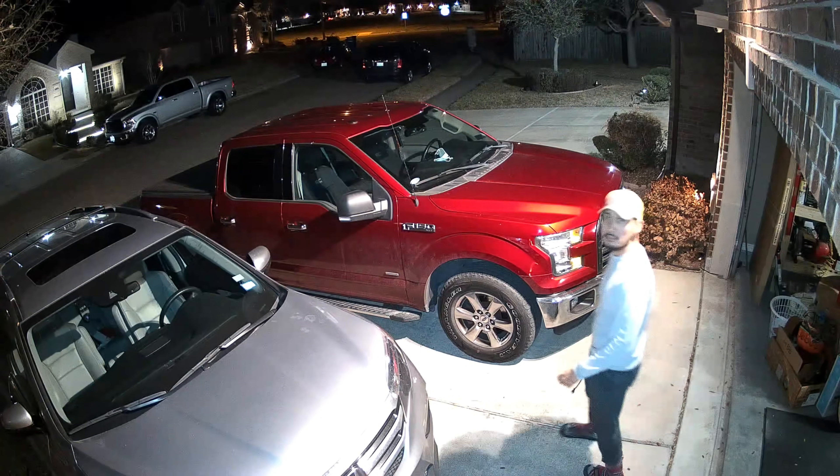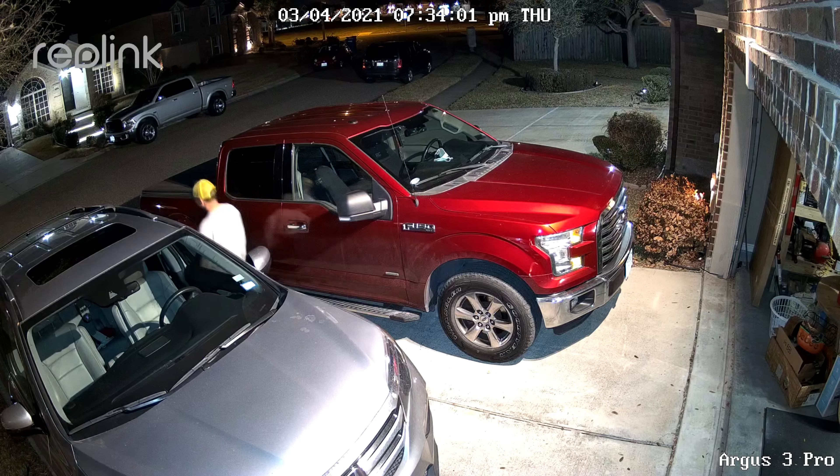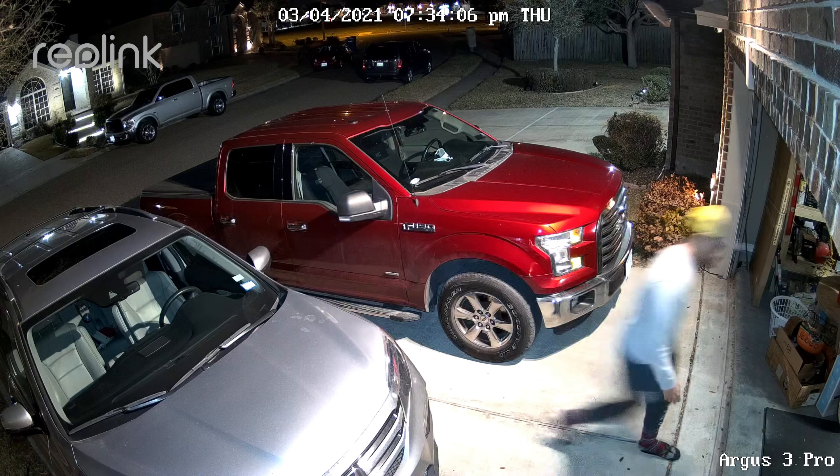The video and audio quality of the recording is the usual Reolink quality, which is pretty good, but there is a bit of an issue and hopefully Reolink will be able to fix or update this soon — and that is the frame rate of the recording at night. In both black and white night vision and spotlight-on color recording it slows down to only 6 to 7 frames per second. Video quality is amazing if the person or object stays still, but if they move around 6 fps is not going to cut it. I'm hoping Reolink fixes this before they roll out the final product.